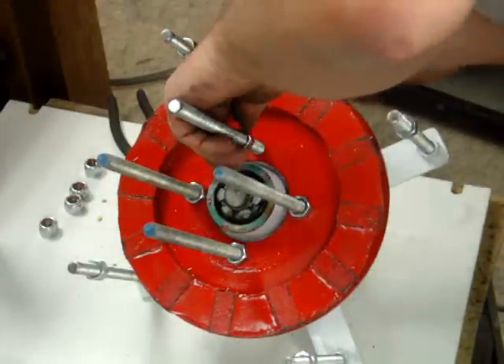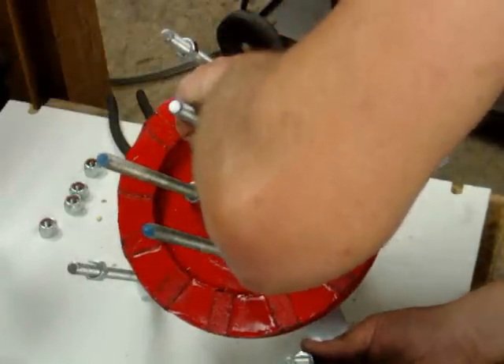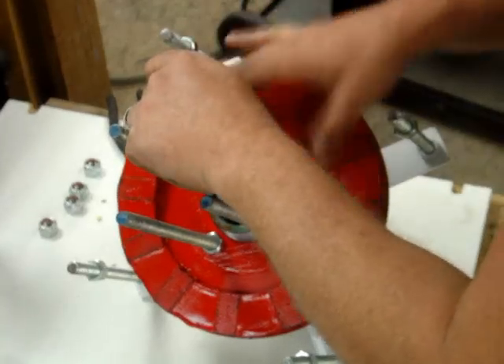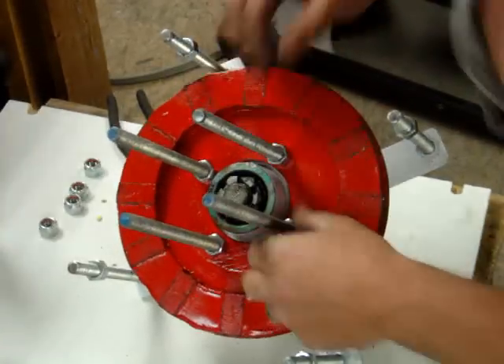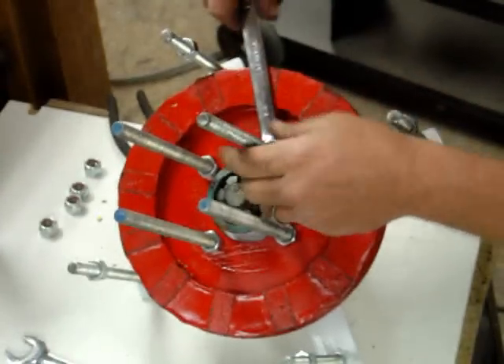The nuts on the top of the rotor, so it ain't free floating. And these sit just below the level of the magnets. That keeps them from hitting the inside of the stator when the stator comes down. Does that have adjusted up about where I want? Yep. That one was too high. Too high. There we go. Get that down. Alright, let's tighten these up.